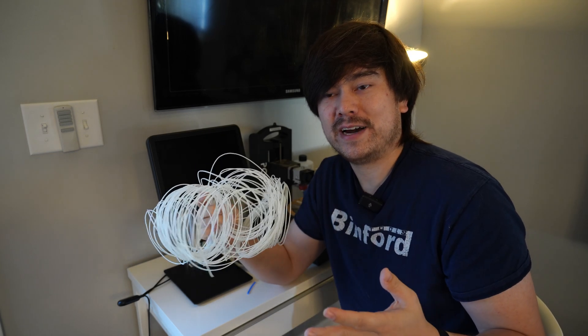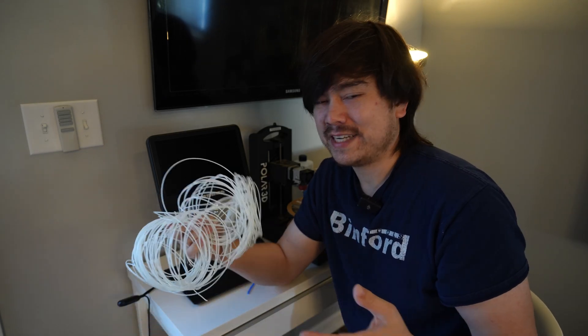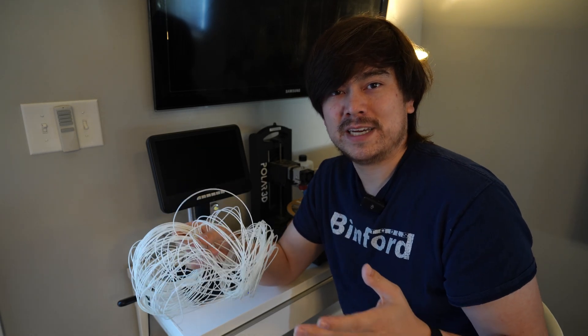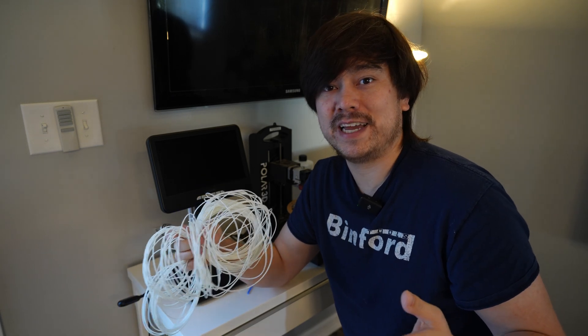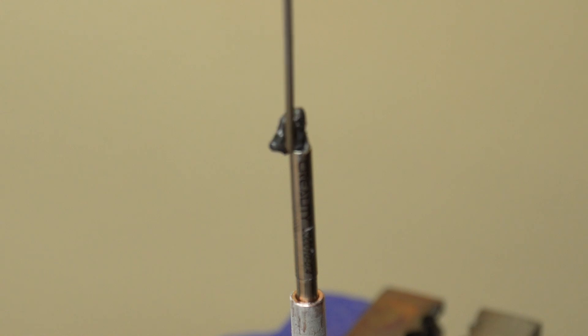So what are the takeaways here? If you ever drop your filament or get it dirty somehow, it's going to be much better to just throw that away instead of risking a nozzle clog. Because in the best case it'll completely clog the nozzle and you'll know you have a problem — but in the worst case, it can constrict the nozzle and cause under-extrusion, which will give you really weak parts and you might not even notice it. If you have contaminated filament, it's much easier to just replace that spool. It's only about $12 to get a brand new one-kilogram spool of PLA online, so just buy that and you'll prevent yourself from needing more replacement parts and more extensive repair.